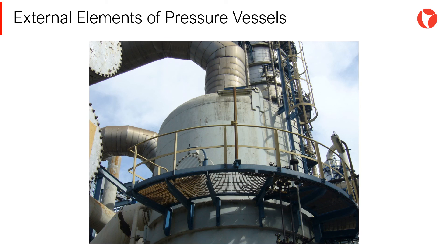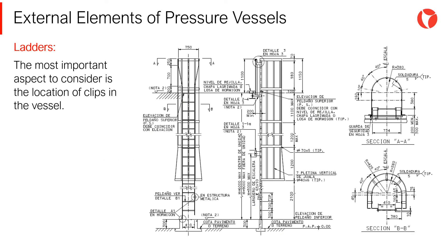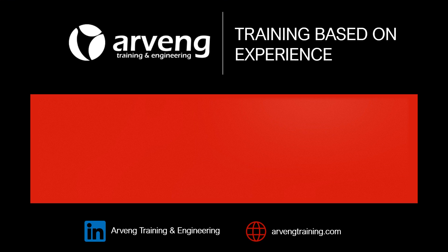The picture on the screen shows a partial platform to access the manhole, the instrumentation associated with that platform level, and space to access the staircase leading to the upper level. Same as for platforms, the dimensions, requirements, and distances are indicated in the project specification. If such specification is not available, it is necessary to use existing standards that reflect good engineering practices.